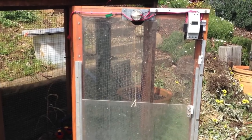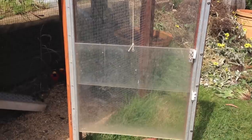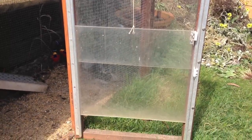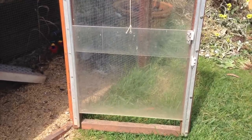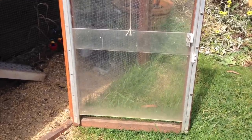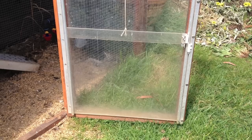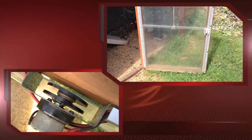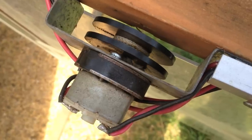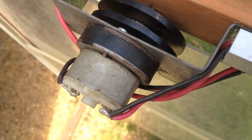You can see the door being lowered, the motor controlled by the timer, the relay switches allowing the motor to work, and the door continues to go down — guided in its rails or sail track until the limit switches are reached and then it automatically shuts off. You can see the motor winding the pulley, the pulley winding up the cord and as a result bringing the door up.